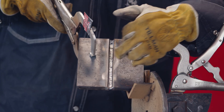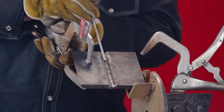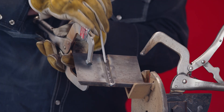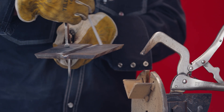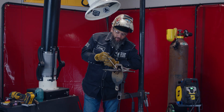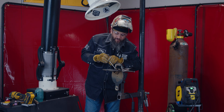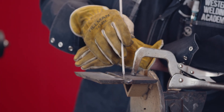You can see how this is laying flat with no slag trapped in the sides. Another important thing on a plate test: when you get to the end, come off just a bit, push back in, pause and hold every pass. You'll see it swell up and fill up, then snap it out. If you just run off the end you're going to get a dished-out spot. On three-eighths plate it's not a big deal, but on a one-inch test that's going to cut out very big in the end and you'll fail. For fill passes, I put the centerline of my rod on the edge of my hot pass and come down one side, then stack another on the other side - watching my weld puddle come right to the bevel edge without burning it off.